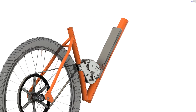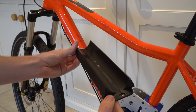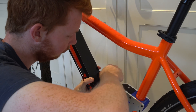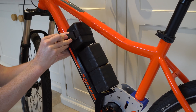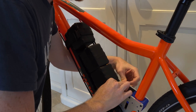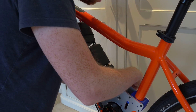I'm currently waiting on the small pulleys to arrive in the post, so I set about designing the battery mount. It's a very basic mount and isn't too different from the version 3 electric bike design — essentially it bolts to the bottle mounting holes to prevent the battery twisting on the frame, and then the batteries are simply velcroed to it. I decided to print this from 3D Prints UK PETG plastic filament to make sure it was strong enough to hold the weight of the battery, with velcro straps running around the battery and frame creating a clamping effect.